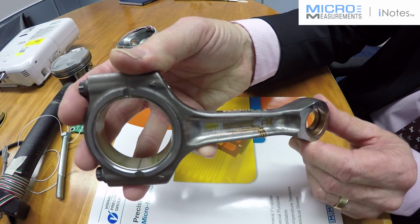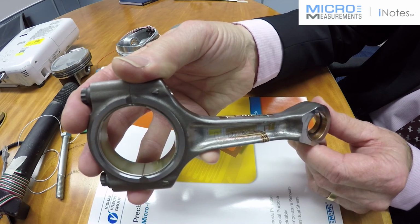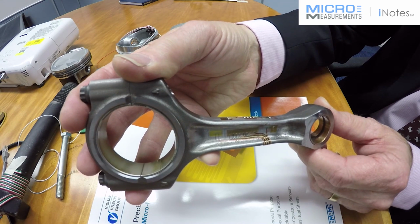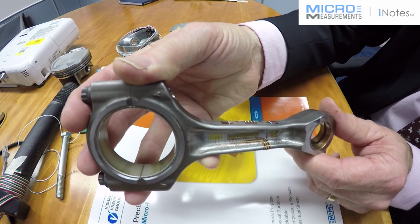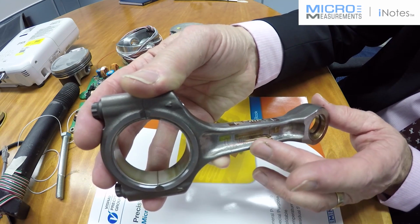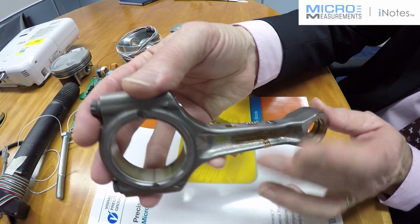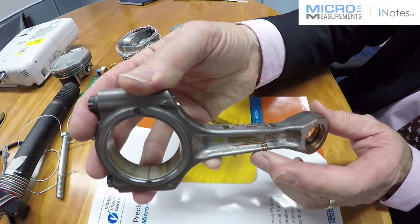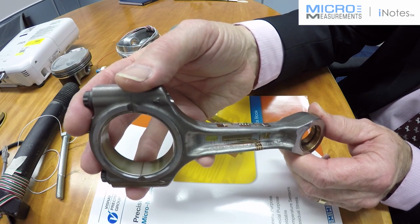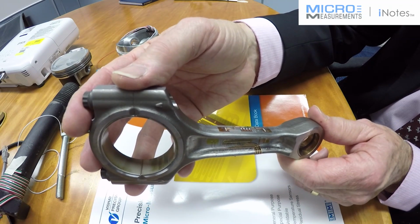And it was quite a tight bend in actual fact. It was very, very close together, so most of those gauges in this middle section were reading very close to each other. And the gradient in the center, in fact, was over a very short distance, if you wanted to get the peak strain. And eventually they took all of this off of here to put into a real engine, put a single strain gauge in the identified area, and this lot was encapsulated, and it was used in a prototype engine to see how it behaved and how they could strengthen this area to improve its performance when it sees bending.